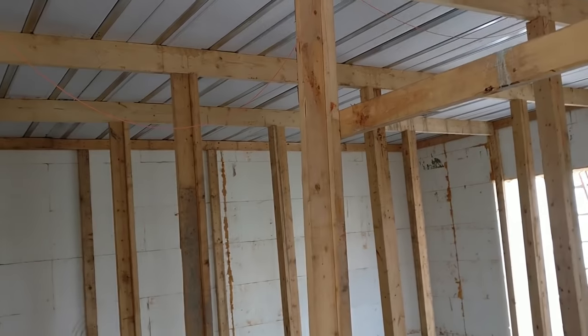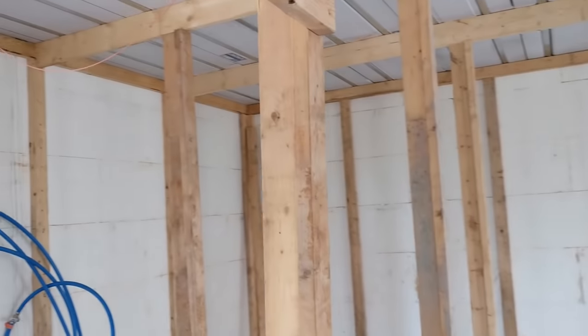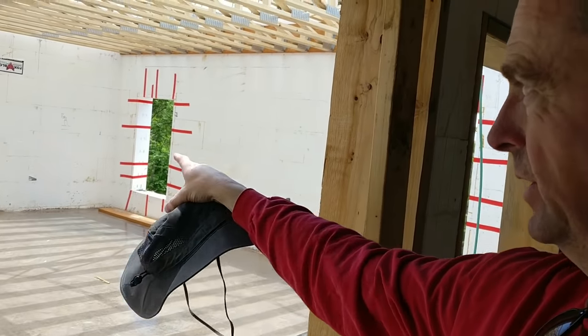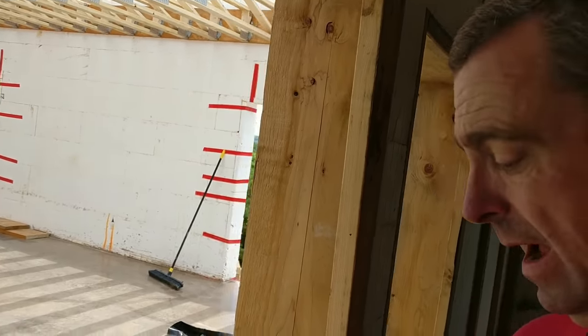Now we're going to show you, now that the concrete has dried from our pour for the floor, I can actually walk in here and show you it looks pretty much the same as it did while they were pouring. Walk around here and show some of the bracing. I believe we are maybe two weeks away from being able to pull these down, which is nice because once we get this next floor done we'll start on the walls and we're going to need all this wood for our bracing. The nice thing is we'll use this wood probably three to four times on the different pours before we use it in our interior walls.